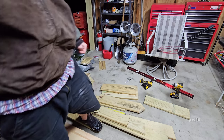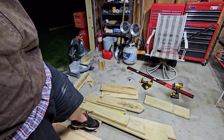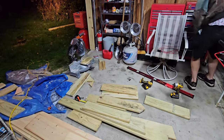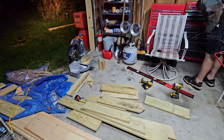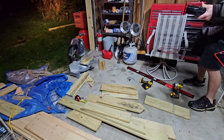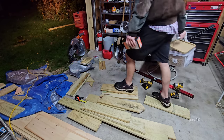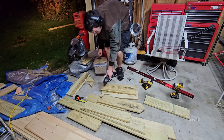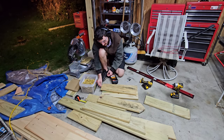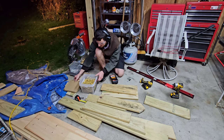This entire house needs pilot holes, or I'm gonna maybe crack it. Just came back out with some drill bits. It definitely needs pilot holes because I've cracked this kind of wood before. It's decking. If you screw it down like decking, you'll be fine. But like I'm doing, I'm screwing into the ends and that can split it. And I'm also using very unnecessarily long screws just because I have so many of them.